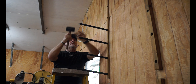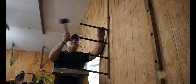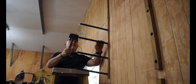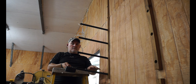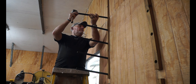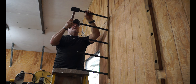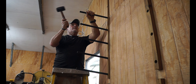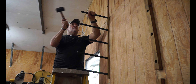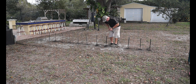I'm just using a rubber mallet to install the steel pipe. The depth is around two inches. You don't have to hit it that hard — just tap it and you'll be able to tell once it bottoms out, then they all line up. The half-inch piping seems to be enough as long as you keep the spacing at 12 inches on center; that way you can't overload a shelf.